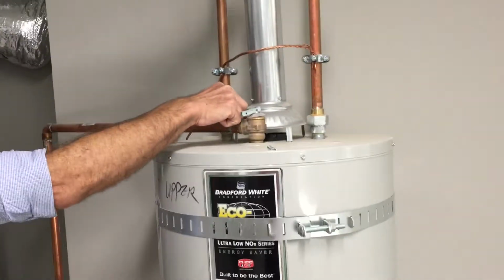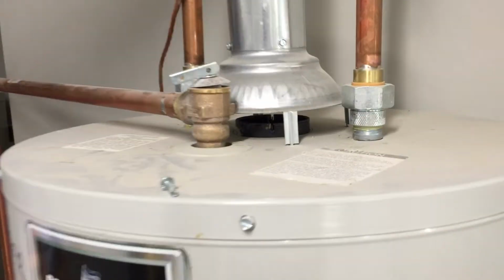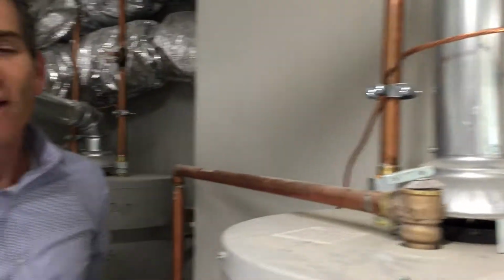What we want to make sure is that they have a really low percentage of carbon monoxide. I've seen older equipment where you start measuring and all of a sudden you see 100, 200, 300, 400, 500, 900 parts per million of carbon monoxide, stuff like that. Boom, it's red tagged, it's no good. That machine needs to be gotten rid of, replaced, or fixed.